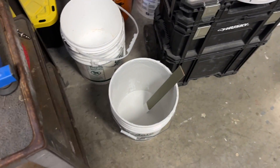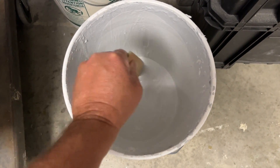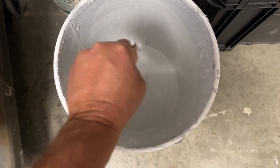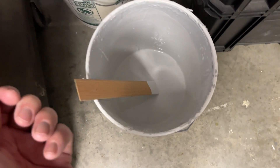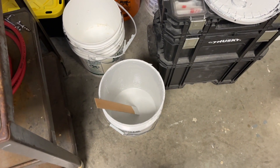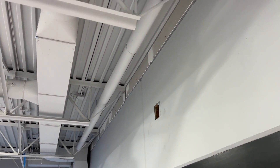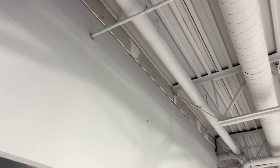I think I have enough paint — about three quarters of a gallon. I've added a little bit of water to thin it down just a bit because this latex paint is pretty thick to blow through a sprayer. I've got a good consistency. All I'm actually painting is one sheet of drywall — one four by eight sheet — just stretched out over a long distance. So three quarters of a gallon should be enough.